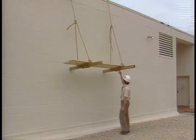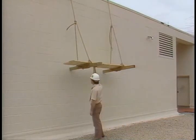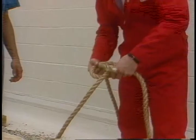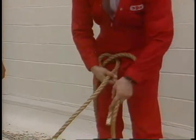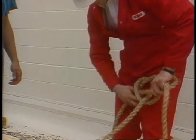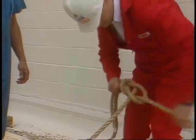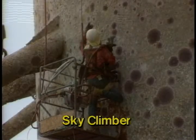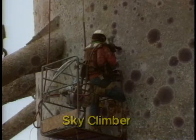When both sides are rigged, the platform can be dropped over the side, over a pontoon, or brought to wherever it's needed. If you're going to be doing this for the first time, review this section several times and ask the barge engineer to oversee the construction of your scaffolding. It's also a good idea to practice the knots before the time comes to use them. Don't forget to wear a lifeline, but avoid supporting personnel with air tuggers. Skyclimbers are designed specifically for this purpose. The drive motor is located in the basket and the cable is secured at deck level.